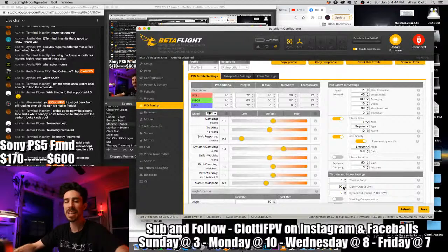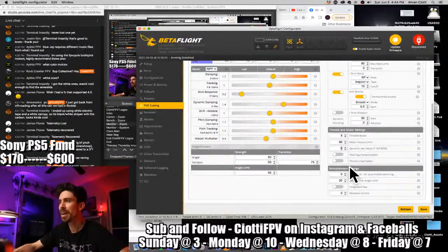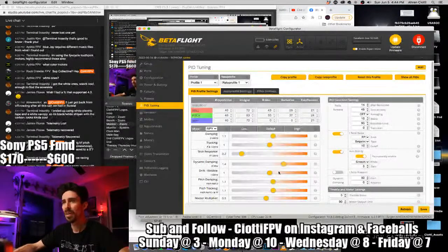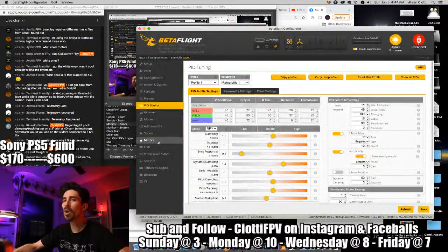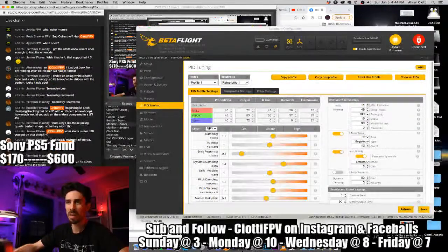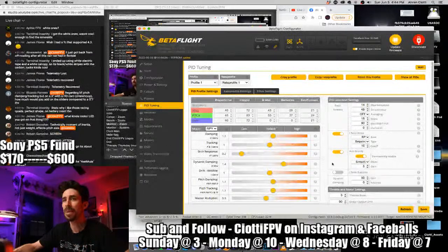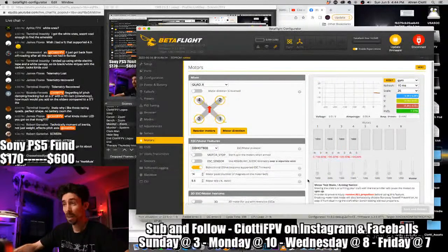Let's start off at 90%, and then we can move it up if we need more. Dynamic idle value, let's get that set right now. So here's how you set your dynamic idle. Rosser does have a video on this with some blanket numbers that you can drop in there. I prefer to do it like the old school way because all the motors are slightly different. Here's how you do it.